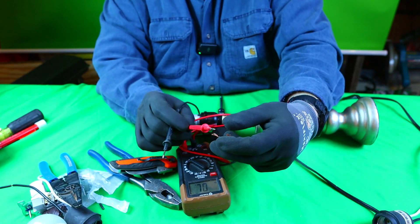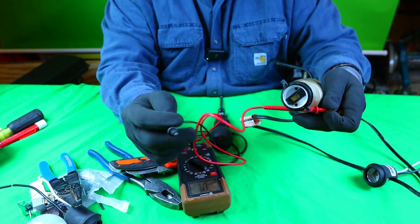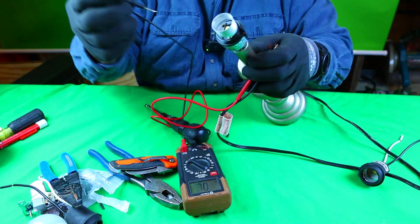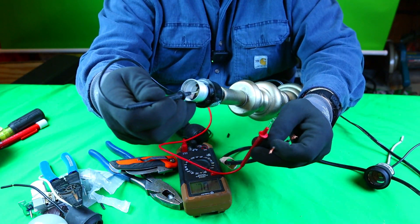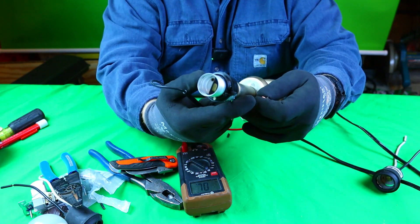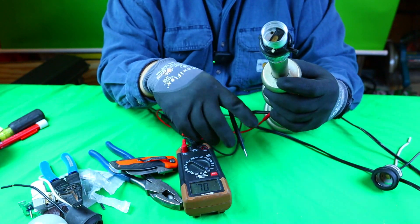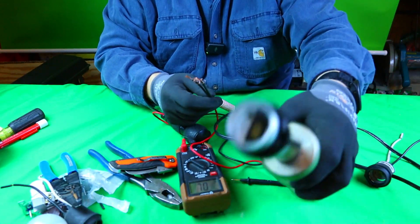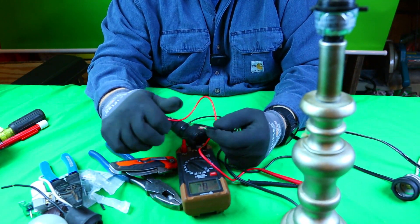The only thing that would not potentially beep through is right in the middle. We'll try the other one, and now we'll turn it off. We'll see if it beeps through, and it doesn't, so we know that the switch works. So we know now that on this lamp right here, that this side is your neutral. Now let's make the plug up together. Let's take our plug loose.